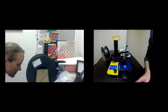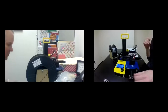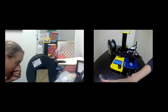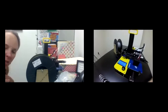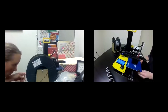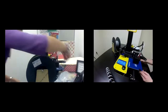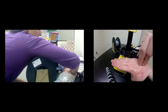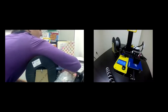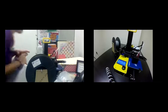If it's too close, what do you do? Twist the knobs at the bottom — righty tighty to pull the build plate down — which would allow it to print better. What's happening is the nozzle is so close to the build plate it's not able to squirt any plastic out. Usually you only have to adjust them maybe a quarter of a turn. Do you see it a little bit now? I see a line of filament hanging out of it and it's doing something.